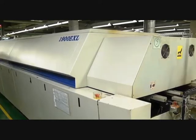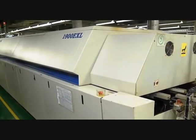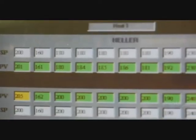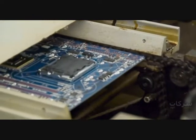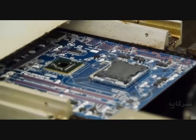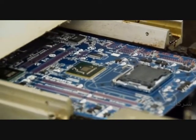At this point your motherboard has SMDs on the PCB and can go to the reflow oven for the soldering process. The soldering paste is melted by the high temperature and sticks to the components and the PCB. The temperature reaches as high as 245 degrees Celsius as the motherboard moves through different levels, and at this point electrical and mechanical connections are made.